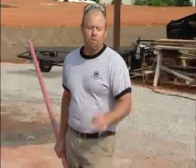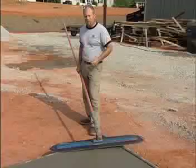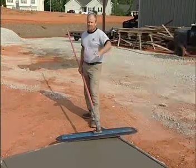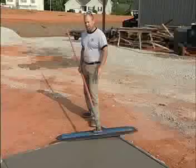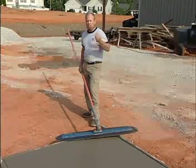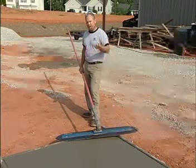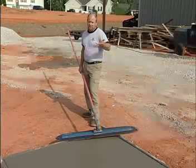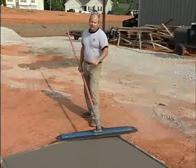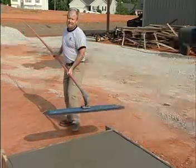Let's take a look at how this tool is used. Here we are with our Fresno — in this case it's called the big old blue Fresno trowel. Remember, in certain parts of the country, especially where you have freeze-thaw environments, they really shy away from using a steel Fresno on fresh concrete. The reason is you don't want to trap moisture or bleed water prematurely. But assuming the slab has no free-standing moisture — referred to as bleed water — on occasion we will use a steel Fresno, but you can't have any standing bleed water.